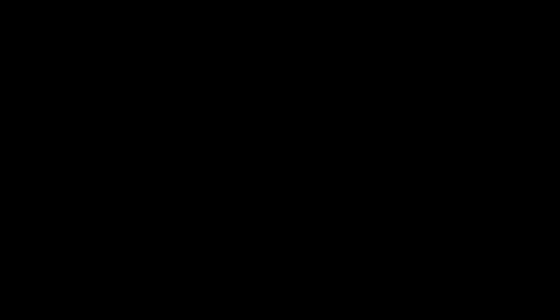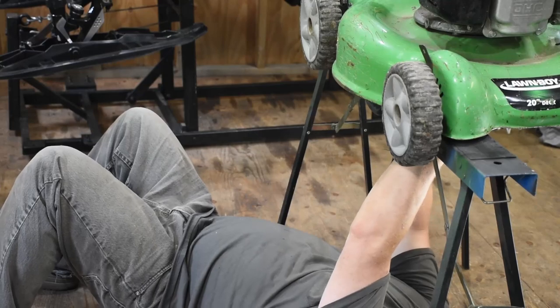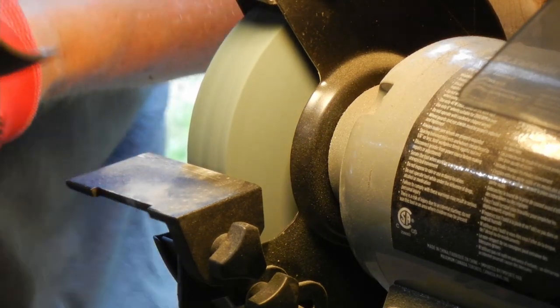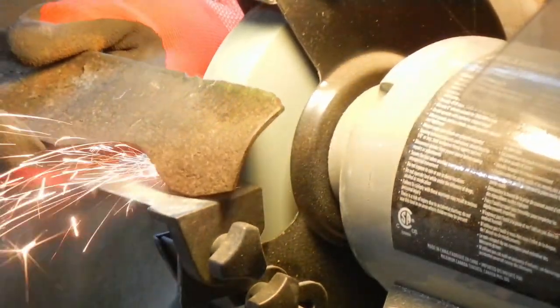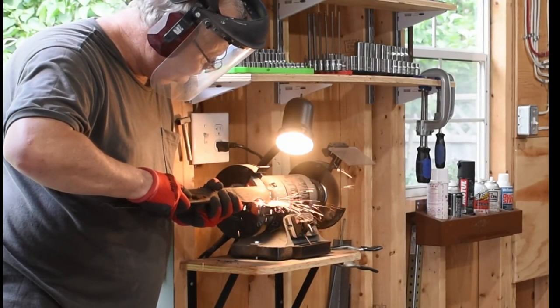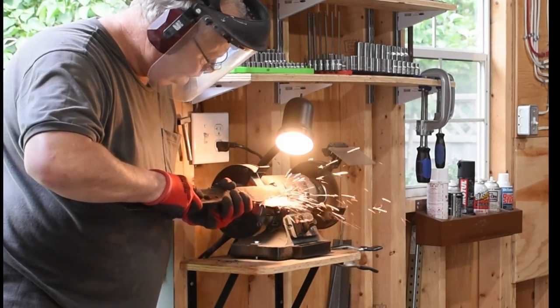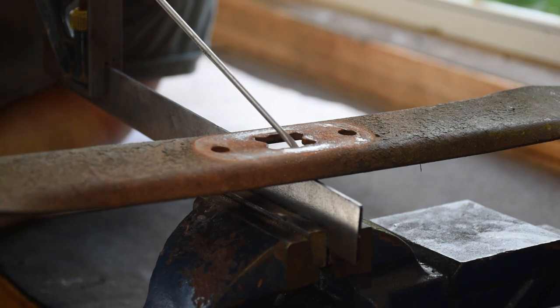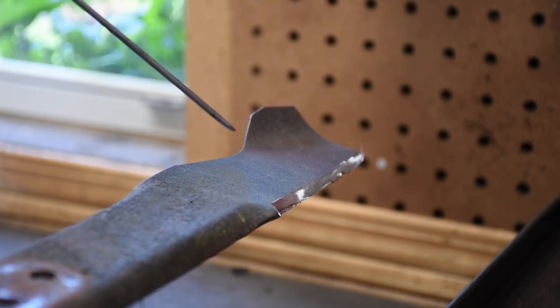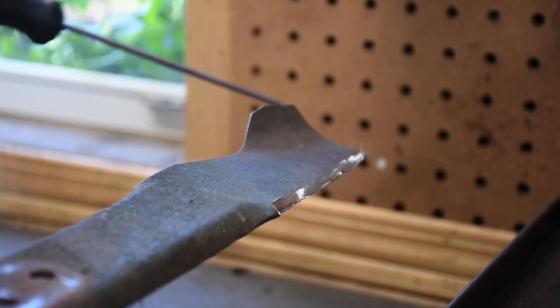I was going to show you a full blade sharpening tutorial, but this video is getting a little bit long and this blade is kind of weird — it's got these cutouts in behind the wings which made it difficult to really get a good edge on and show you a proper sharpening method. I managed to get it done, but I think I'm going to do a follow-up video showing a better method. Also, this blade has a square hole instead of a round hole in the middle which made balancing hard — I ended up using a tri-square in my vice to get it flat. The blade was in rough shape so I never did get a really good edge on it, and I'd like to show you what a good edge really looks like, so we'll follow up later.